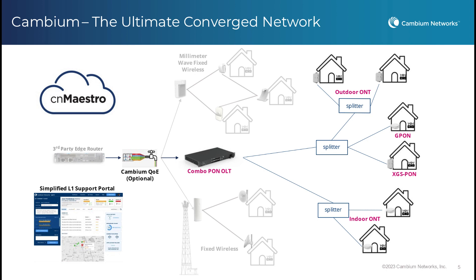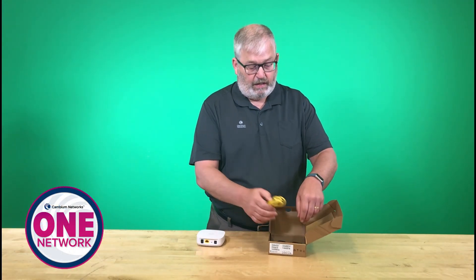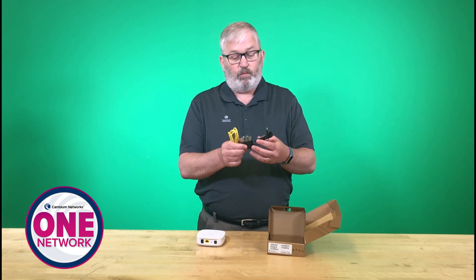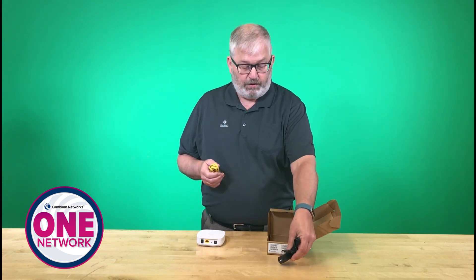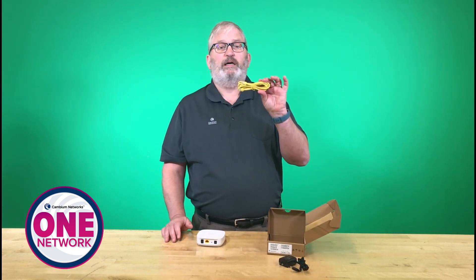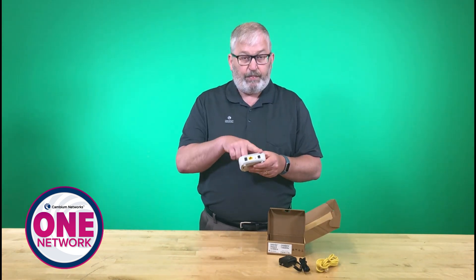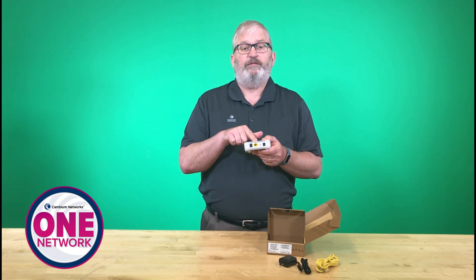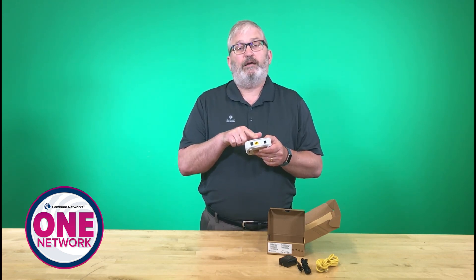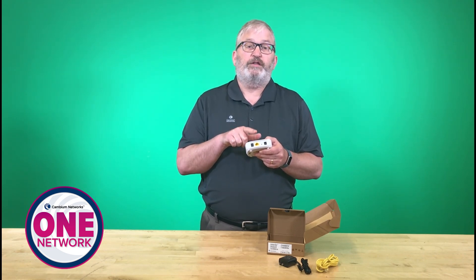So I've mentioned the devices here. The power input — I'll show you what that includes. This includes just a wall wart-type supply. This is the US version, and there's a different version depending on which country you're deploying this in. It also comes with a 2-meter ethernet cable. The power comes in here, you've got the PON, 2.5 gig on the XGS PON, and 100 meg / 1 gig on the G PON.